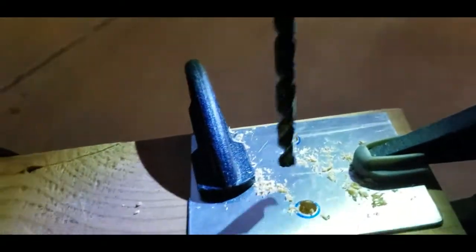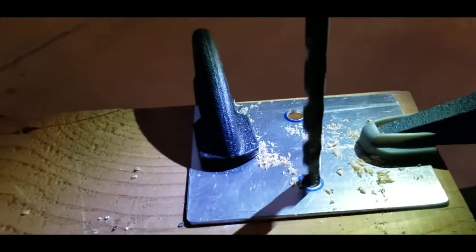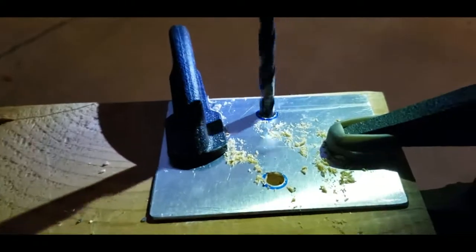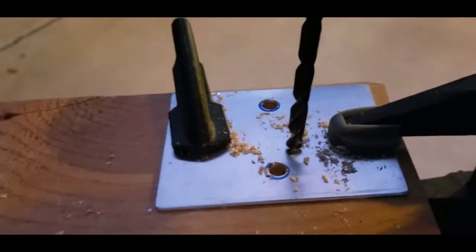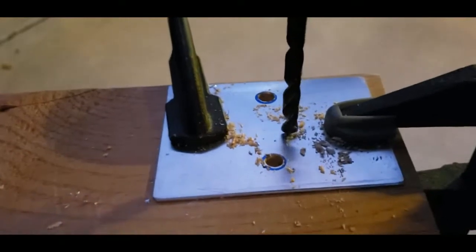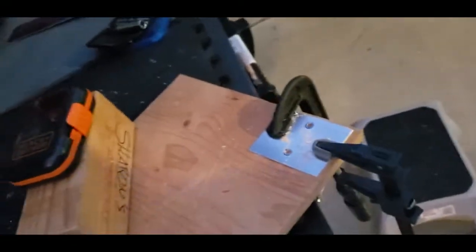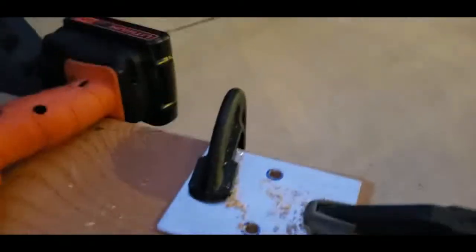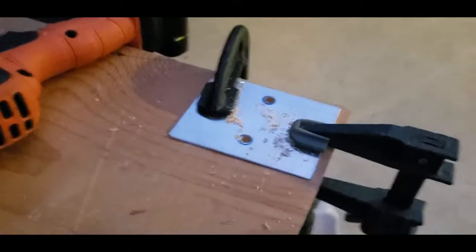Make sure safety first. So when you're drilling, make sure that's secured down somehow. I don't have a vise because, well, I live in a truck. I don't have room. I got a clamp-on vise, but it's too small. So I'm using these wood clamps, actually. I clamped it on a block of wood, holding it down. So, food for thought: don't let that metal thing start spinning when you're trying to drill 5/16 holes in it.